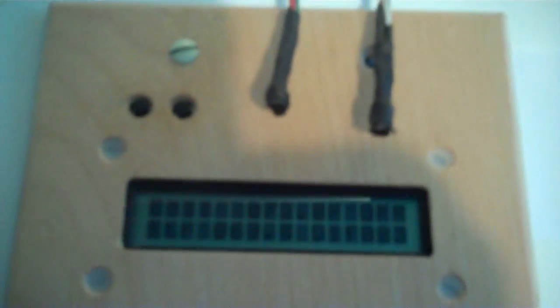The user is able to program this with just two buttons — this is the increment button and this is the decrement button. We have the probes that we'll be using: this is the collector probe and this is the storage probe. The first thing we want to do is a quick test to make sure that our pump is working, so we're going to cycle through the menu and turn on the pump.